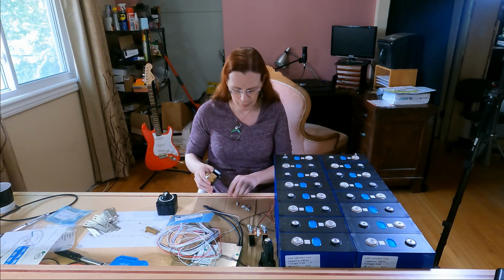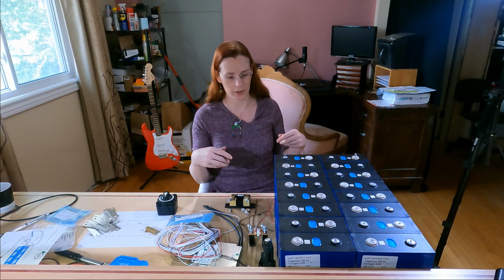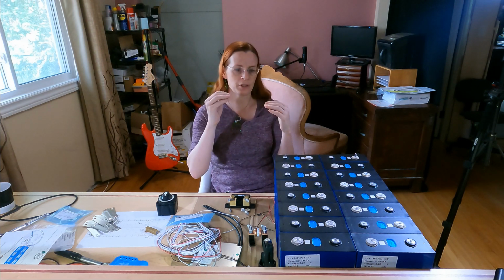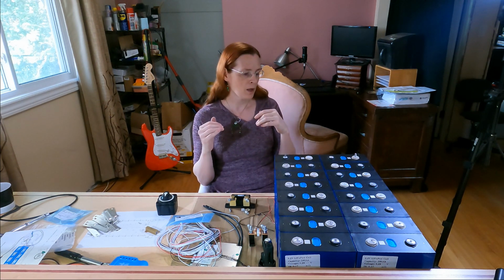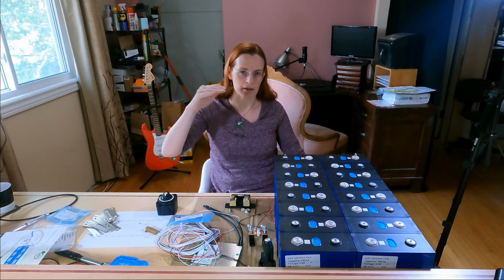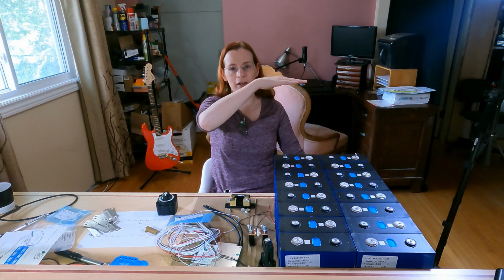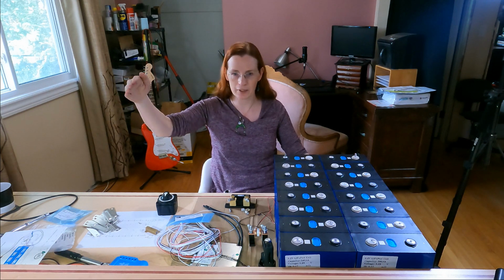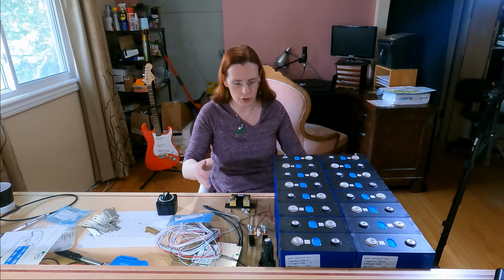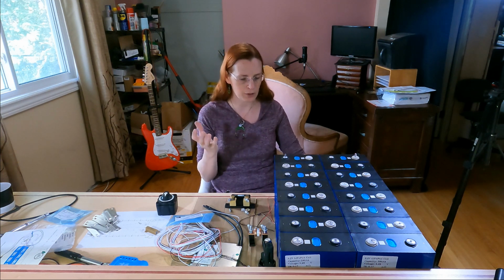One of the things when people who are familiar with traditional lead acid AGM batteries, as I was, you're used to being able to use the voltage to decide what is the state of charge. With lithium iron phosphate, the voltages are very consistent. So when you first start to discharge the battery, they drop, and then they hit a steady state, and they hold that steady state pretty much entirely until the end of the charge cycle, and then the voltage just falls off a cliff. So you have to have a little bit more smarts to be able to know what percentage of my energy is still left in the batteries. And that's what the smart shunt provides you.